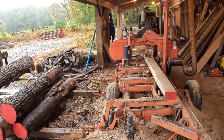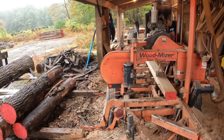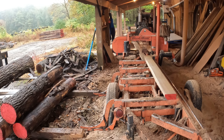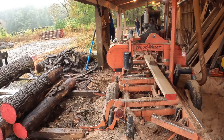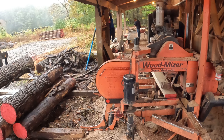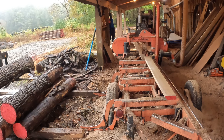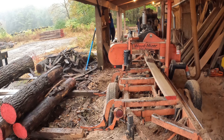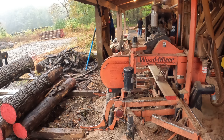As I remember, the next board would be the same situation — it's just going to get trimmed back. I always have a lumber crayon on me, and a lot of times you can't see because the saw head is in the way, but I'll make marks on the boards so my stacker knows which stack to put them on. I have two stacks going — a select stack and a common grade stack. If a board needs to be cut I'll put a mark where it needs to be cut so he knows, as it comes down the rollers, what to do with it. Those are powered rollers, so I just come back onto the rollers, they roll to him, and he'll take it to the edger or the sticker stacker. It makes a pretty streamlined system.